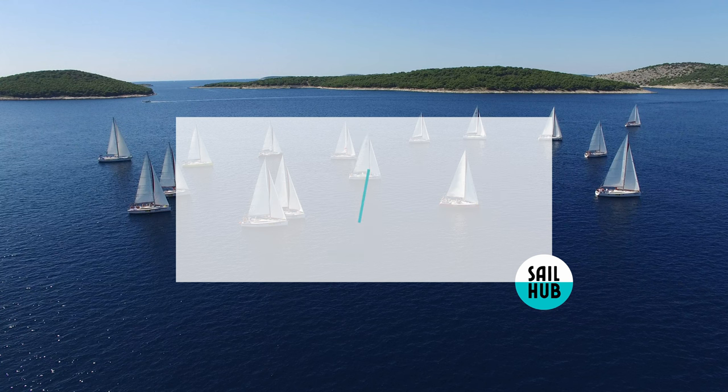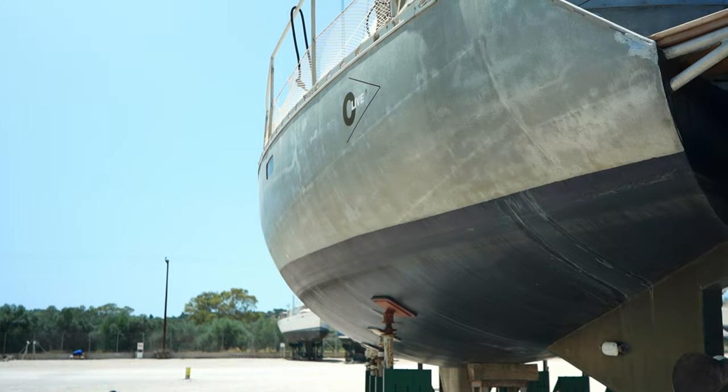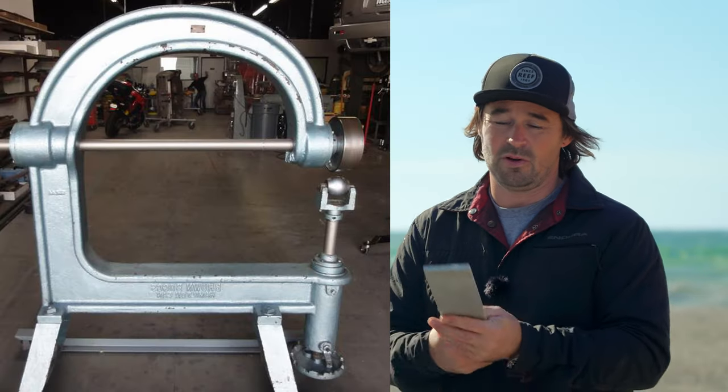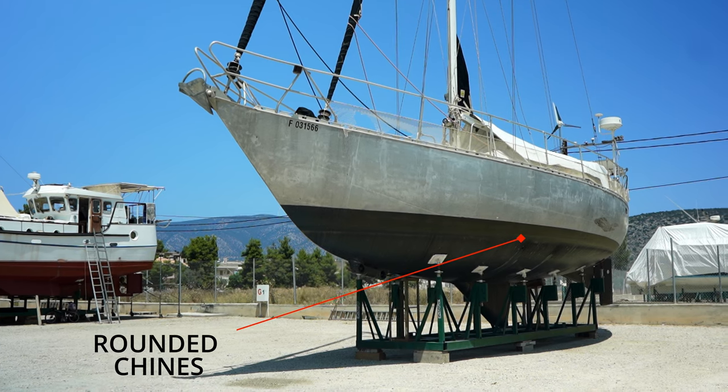Aluminium is definitively a light material. A lot of aluminium boats in the 80s and 90s were made out of aluminium because in general it can be built very thin, but it can be built heavy as well — it's up to you and it can perform really well. You can create nice rounded shapes in two planes, convex or concave, by stretching the material or using something like an English wheel — effectively two rollers which squash the material — so you can create round chines from plates so nicely rounded you'd never know they were made out of plates, making them very hydrodynamic.